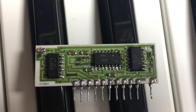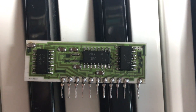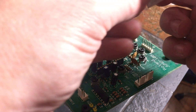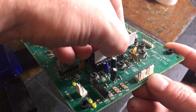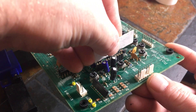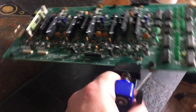Unfortunately, I ran out of space on my phone, so I lost the recordings of me re-soldering, but I've gone through every pin and just re-soldered everything. So now we can place this chip into the new socket. It's worth saying at this point that I thought I found some dry joints on the IC connections, and I actually think that is probably the most likely candidate for these problems. I'm sure components do fail as well, but there are definitely some dry joints in there. Fingers crossed.